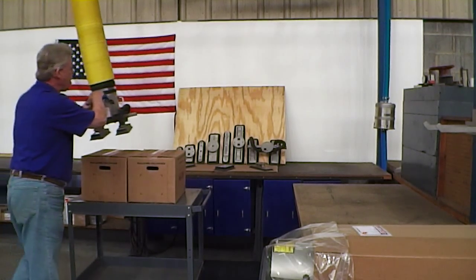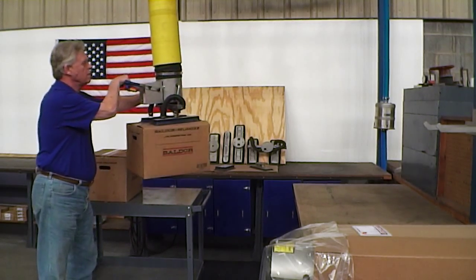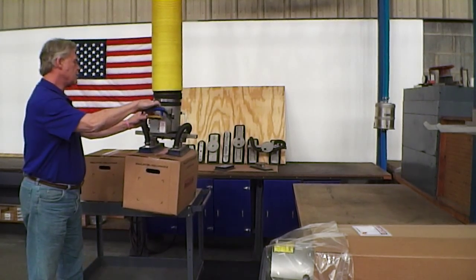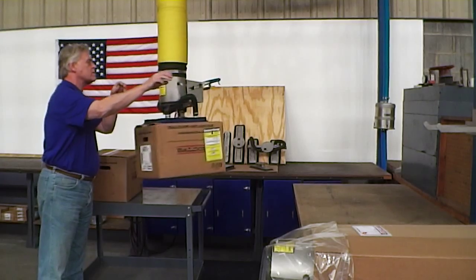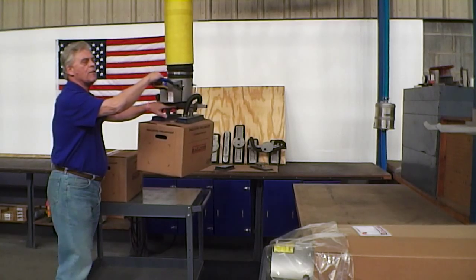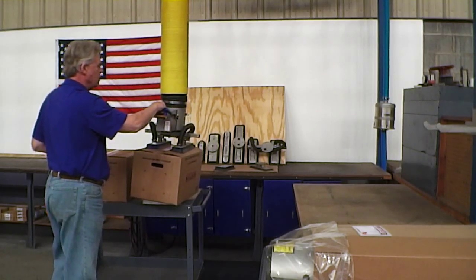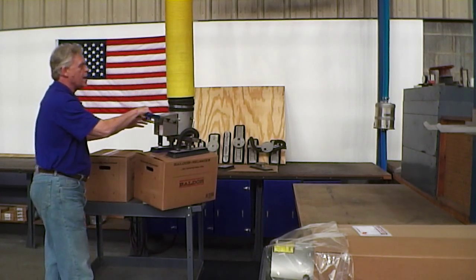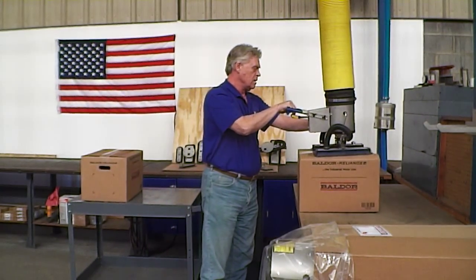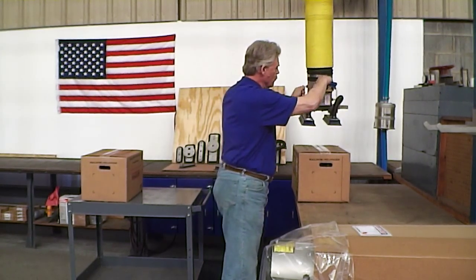So we want to make a lift on a box, and that's not difficult. We have automatic balance control, and we can rotate this box 360 degrees with the top swivel assembly. We also have a bottom swivel that allows for 360-degree rotation of the box without moving the handle. But this is very easy to position on a pallet in any way and remove.